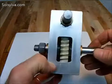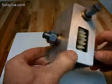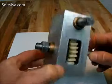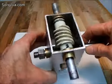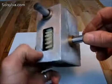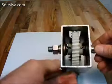The aluminum box was made from a section of 2x3 by 1/8 inch wall rectangular tube, because that is what I had on hand. There are no G-codes for this box. The driven gear does not quite fit in the aluminum, so a hole was milled in the side. This hole could be drilled and filed.